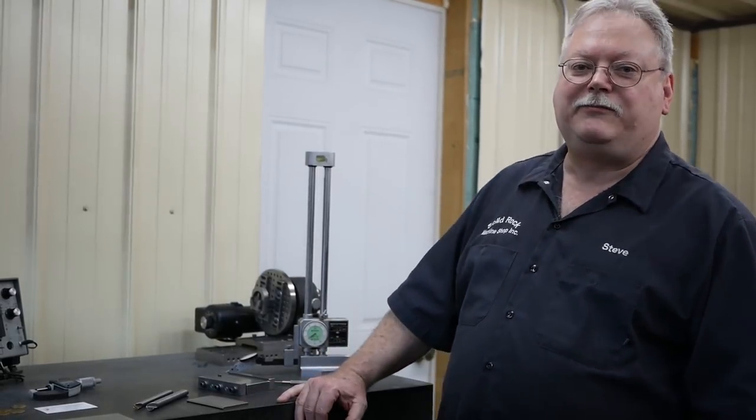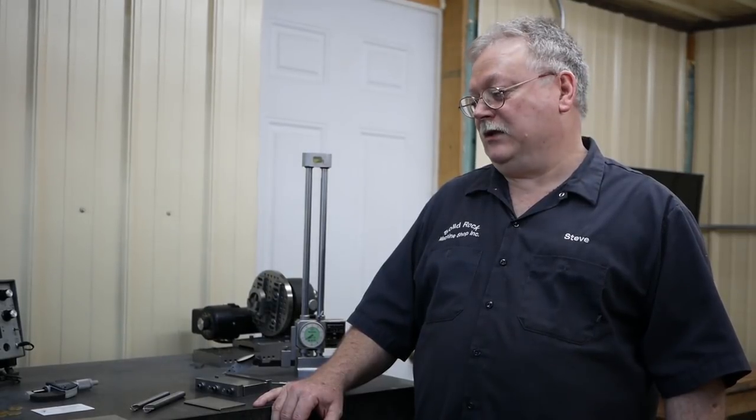All the research I've done before I tried working on titanium and using this green silicon carbide wheel, everything I've read and studied on it, and people's personal experience, kind of left me thinking I might have to throw the towel in on this one. So I approached it wondering what I got myself into, but this wheel Radiac made up for me really worked really nice. I was surprised.